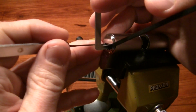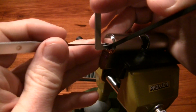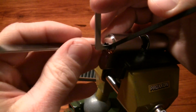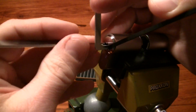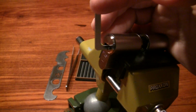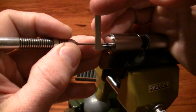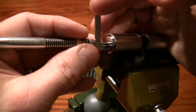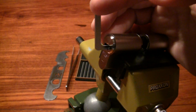So slowly counter-rotating. Not very nice click, but 1 is free. Come on. Add some more clicks, so let's recheck the dimple pins. One seems to be okay, 2 seems to be okay, 3 is okay. We lost 4. Nice click, and the rest seems to be okay.